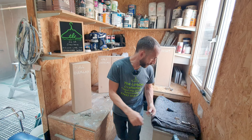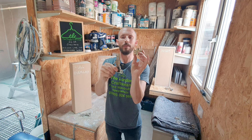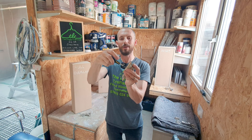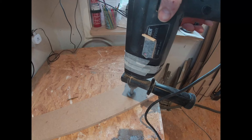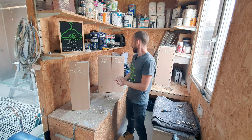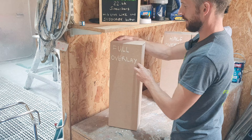The cheaper versions you'll probably get on Amazon just have their own little plates held on with a grub screw at the back. That screw is what detaches from the main plate. If it's not coming away, it's because there's resistance on the grub screw - just move that around. If you try to detach the two and it's not coming away, just turn that grub screw a few times and it should come away.